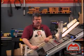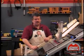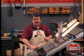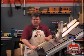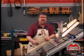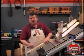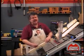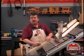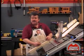It was a very warm winter in Siberia and the northern reaches of Norway, where they get the birch for this particular wood, and the logging trucks couldn't get in. So we're working with seconds and worse on making the Baltic birch right now, and it's not staying as flat as I'd like it to. So if you're going to use it for jig making, you really have to pick your pieces. Is that the questions?